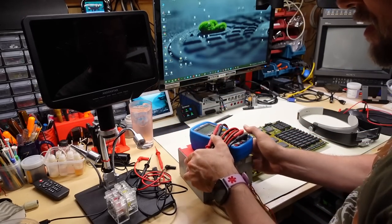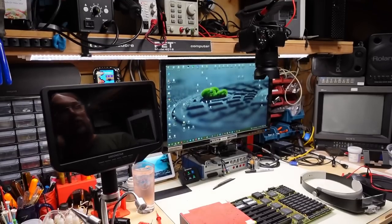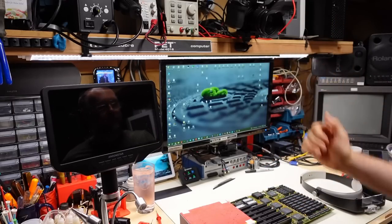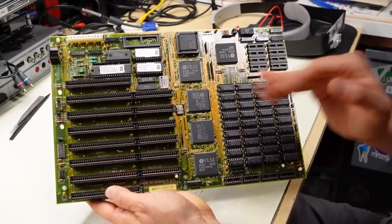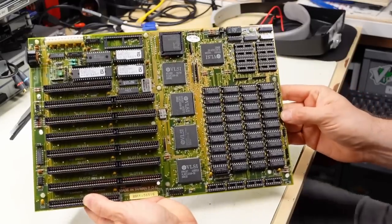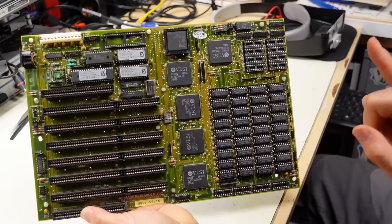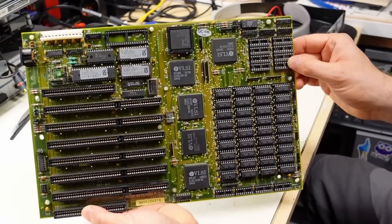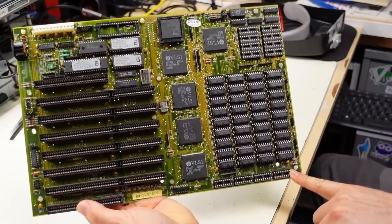Let's take a look with the microscope at the damage on this board. I'm going to move the overhead camera out of the way because it's going to be pretty hard to see trace damage even with the good zoom lens on the Panasonic. Now, this motherboard was given to me completely untested — it's a 286 12 MHz VLSI chipset, pretty much run-of-the-mill. It's got two different types of DRAM sockets, plus some extra sockets. These large DRAM chips are probably for the type where two chips equals one megabyte, so you could potentially install four megabytes of RAM right here.